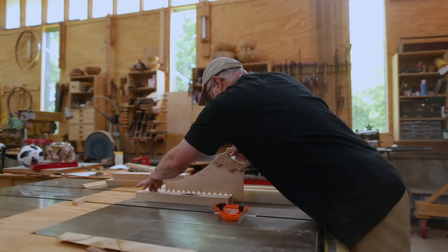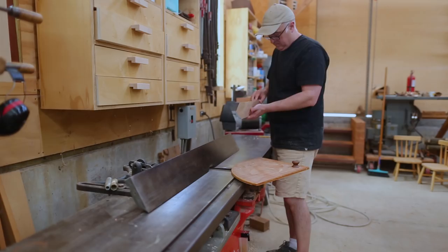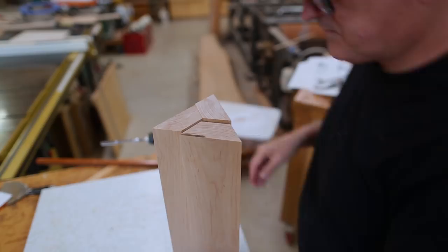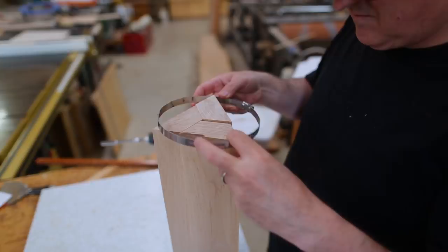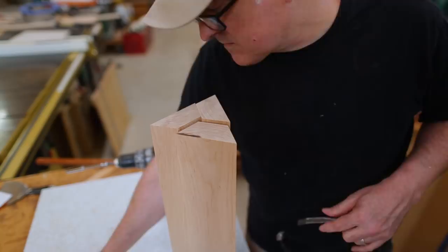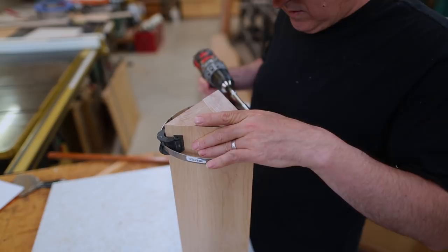If you made six of these segments you could make a ring, but I'm going to use three and make a triangle. I could joint that angle on the joiner. You can see how the three pieces go together. I was trying to figure out how to clamp the three pieces together — just putting a ring around them doesn't really work because the center wants to come apart. I thought about adding something at the corners and found the little clips from the band clamp, but it was the same problem — it didn't really help.